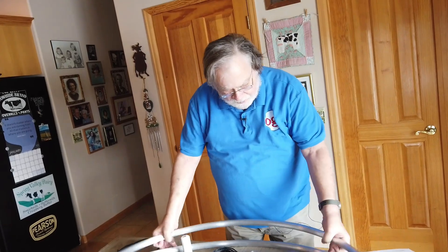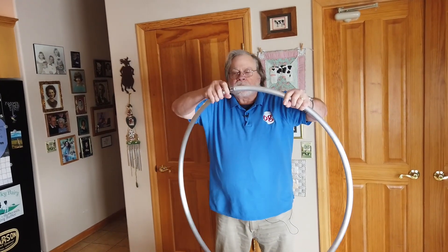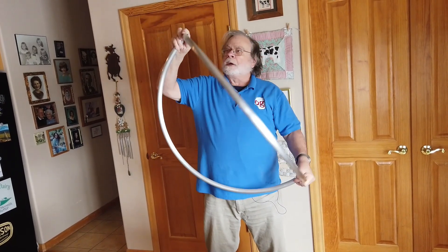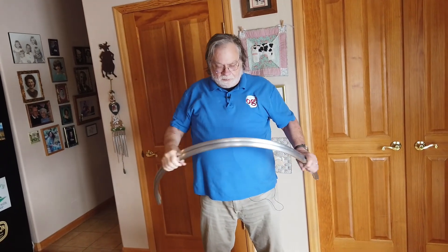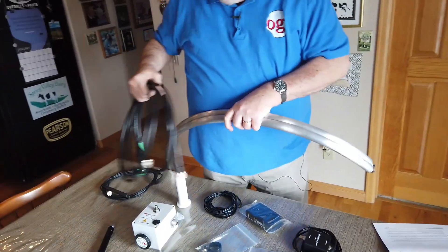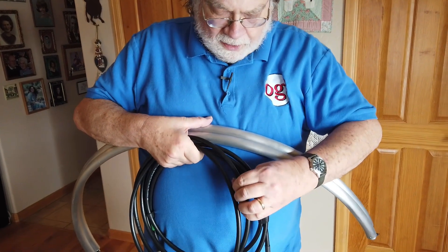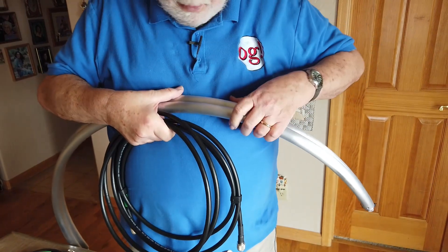Instead of using the coax, the F-loop 3.0+ uses round or circular pieces of pipe — they are hollow aluminum pipe. It's the skin on this. If you look at it and imagine underneath the rubber, there is the outer coax cover serving as the loop. This has much less resistance.